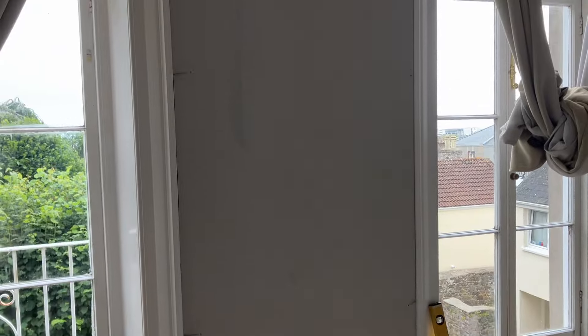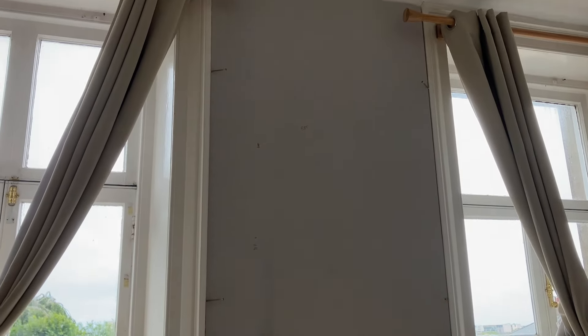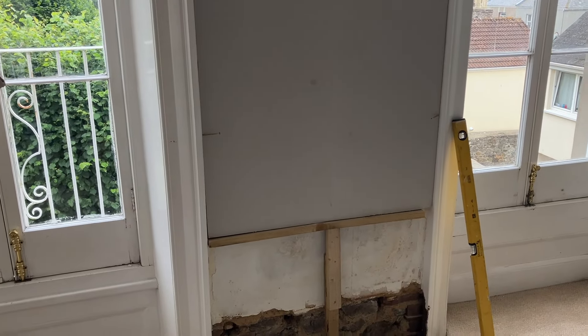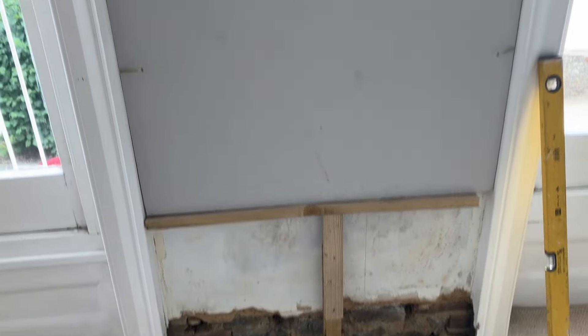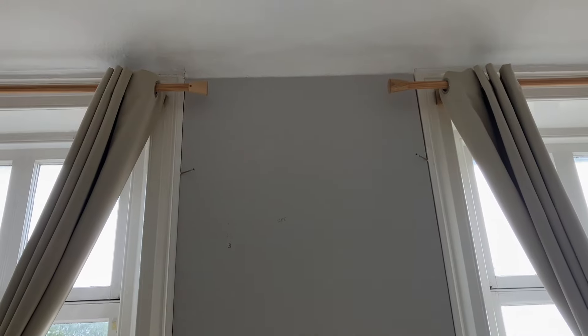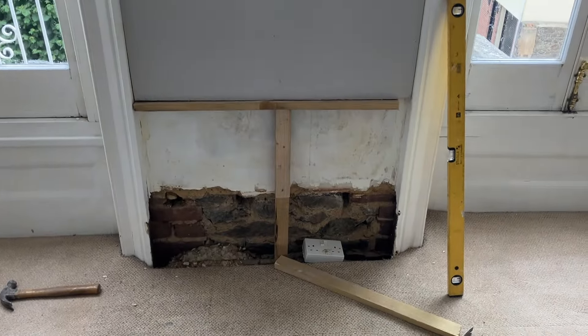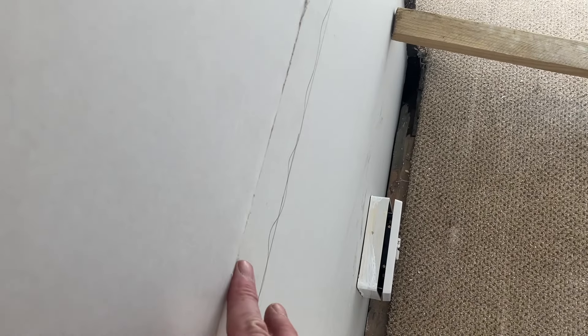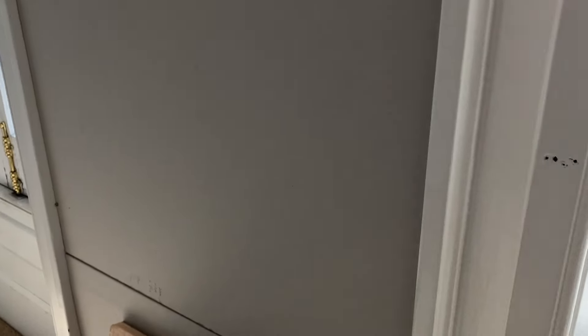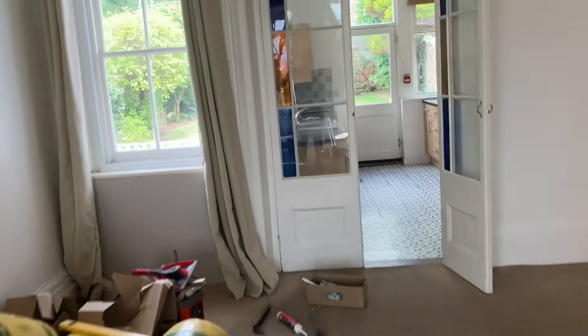That's the first bit on — I've bonded it onto the wall and I've just put a couple of screws to hold it in place until the glue goes off. I'll leave that until tomorrow — just a little prop at the bottom. That's the full length of the sheet because the ceiling is so high — that's an eight-foot sheet and we've still got about three foot left. The bottom's bonded on — this has got the bit I cut off on the sides, the recess. I'll put scrim on that and then fill it, which will stop it from cracking. Same for that one — I'll put a bit more on the bottom but I thought I'd let that go off first.